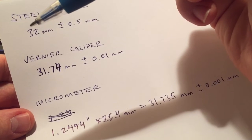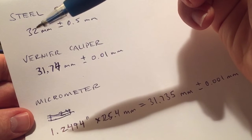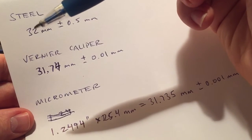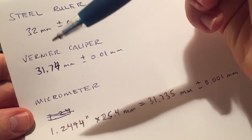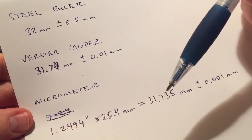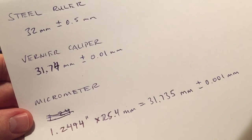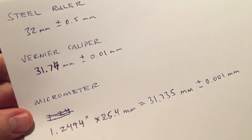These will all be recorded with significant figures. The steel ruler gives two significant figures, the vernier caliper gives four, and the micrometer gives five. Of course, if we were measuring something like three millimeters, we'd only have one significant figure. In each measurement we wouldn't be able to have any more significant figures than those limits allow. So when we are writing these down, we want to make sure we write all significant figures when recording them in the lab. This video shows how these instruments work, what their uncertainty is for each one, how to get them ready, and how to use them for performing measurements.